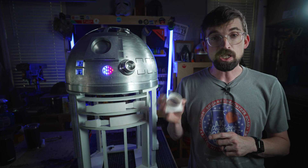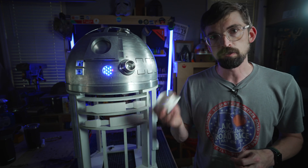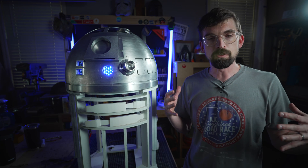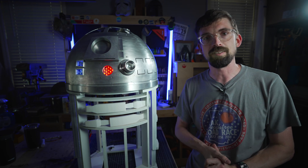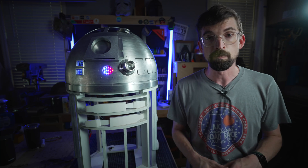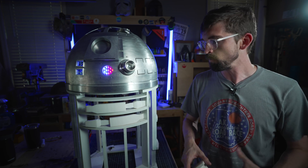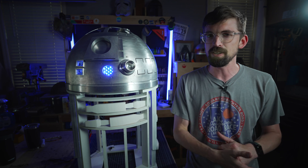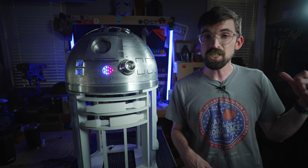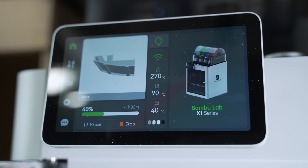With R2, there are going to be a lot of fake aluminum parts that I'm just going to 3D print. On the pro side of 3D printing, you're going to be able to do much more complex designs with a lot more detail — whether with an extruder-style printer or a resin printer, especially on the resin side, the detail is pretty incredible. But speed is definitely not a pro. Doing 3D printed parts is going to take a while. Even on the Bambu machine, you've got at least an hour, if not multiple hours, to produce these parts.